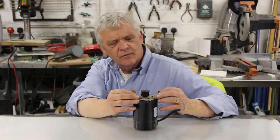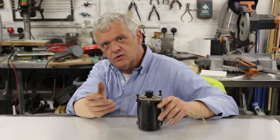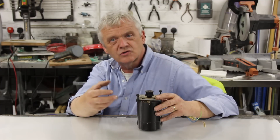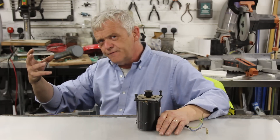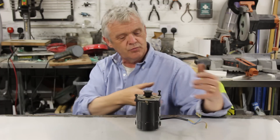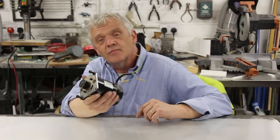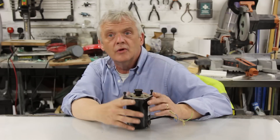That would be an ideal condition, of course, because we wouldn't actually achieve that. These things at their best are about 80% efficient, and something like this is likely to be about 75% efficient. So if I put 150 watts in, I'm likely to get about 112 watts out. Also remember, you can't turn this any faster than 4000 RPM — well, actually you could apply more power — but you'd do the same thing as putting too much electrical power into the motor: you'll just burn it out. So the limit set when it was constructed as a motor is equal to the limit you'll get when using it as a generator. The most you're going to generate is 150 watts, because that's the most you can put into it.